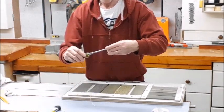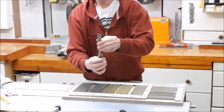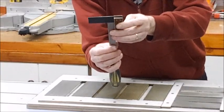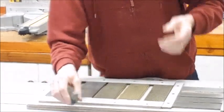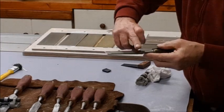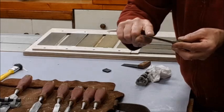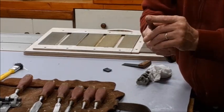It comes with a nice blade guard — that's good. Now it's got a nicely sharpened edge there. You can see that's off though. They're done in a factory, so even a robot can't get it perfect. Now the very first thing you need to concern yourself with on a chisel is the back. The back must always be absolutely beautifully flat and straight off to the end. No curving. If you've got any curving there, it's rubbish — you'll never sharpen it.